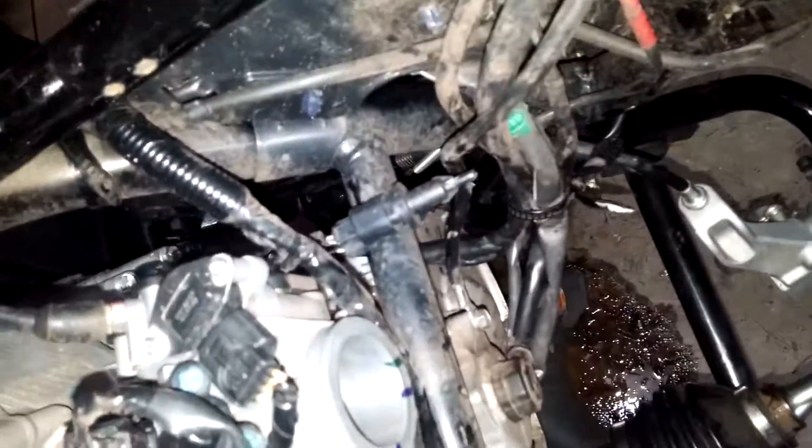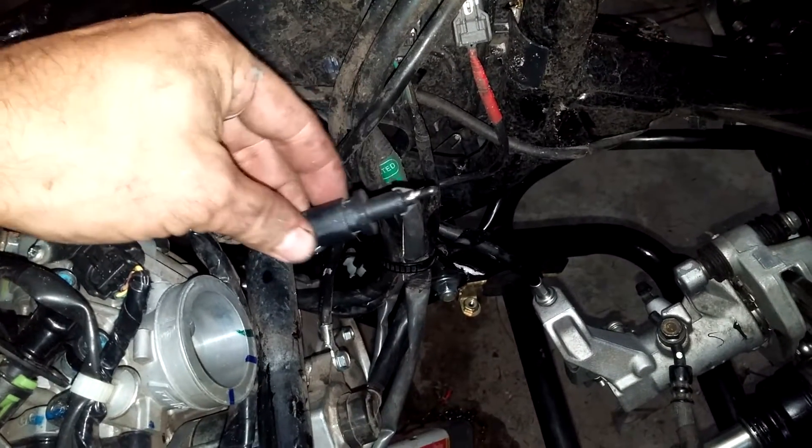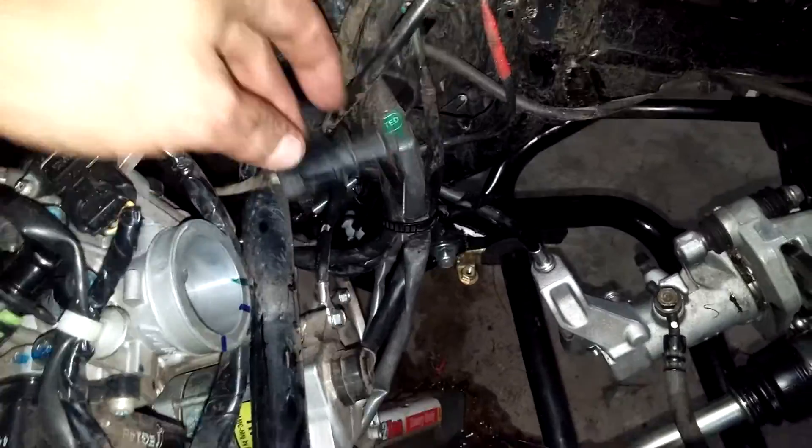There's your rear brakes and everything. Putting the airbox back in is kind of tricky. Don't force it — it goes in at the right angle, none of the boots will get pulled, and it'll be fine. Keep the wires routed the factory way. I recommend putting some ultra gray when you put this in — this is like the airbox temperature sensor — I recommend ultra graying it in because I think it leaks a little bit. That's about all the pro tips I got for you guys, but gear reduction is definitely worth doing.